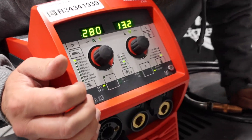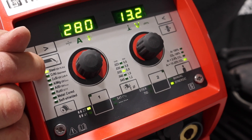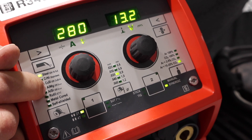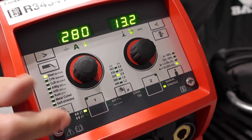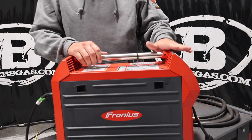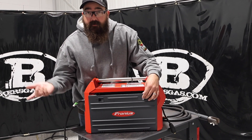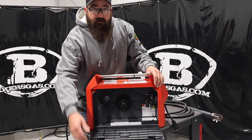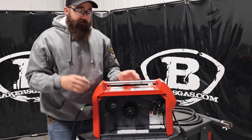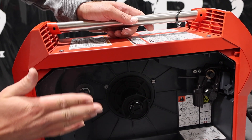We've got it set up for steel ER70S-6 wire — you can toggle down through all those. We can run steel, stainless steel, silicon bronze, and then we can run 5356, 4043, flux core wire, metal core wire, and self-shielded wire. You can run all kinds of different wires on this unit. One of the better features — this thing will push aluminum without a spool gun through the regular MIG torch that you get. On the inside of the machine, you can fit a one or two pound spool for aluminum wire, silicon bronze wire, or smaller flux core inner shield wire.